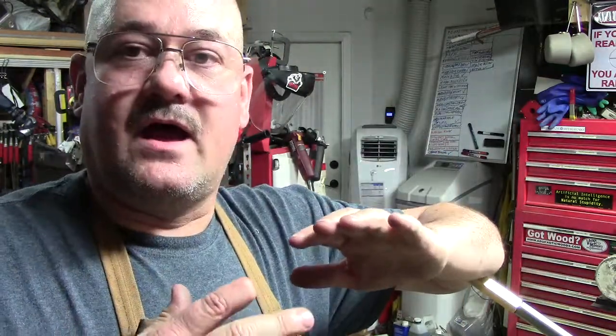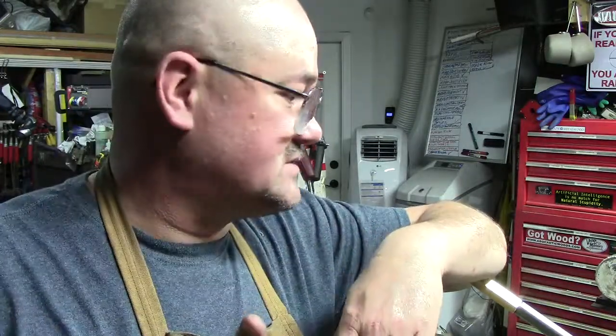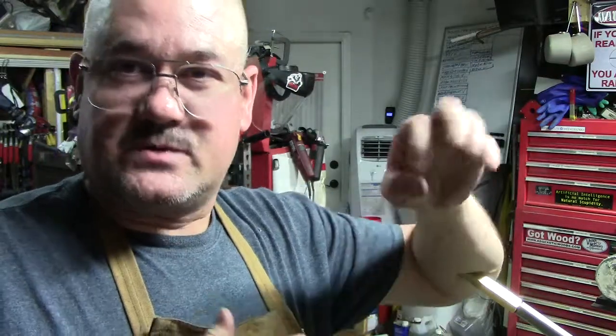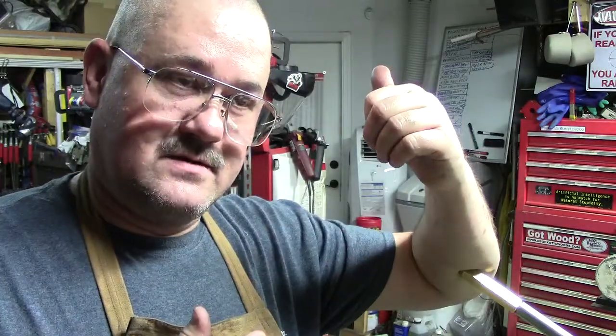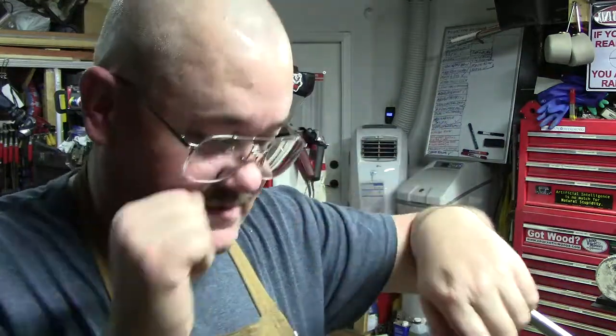Anyway, because we don't know which way something could have moved a couple of tenths, we want to get this dialed in down to pretty much dead nuts. I think within a tenth or a half, let's say within a thou, because we know there's going to be flex over 28 inches. Right now we measured 3 because we're narrow here and wide there, so the tailstock needs to go away from us a little bit.